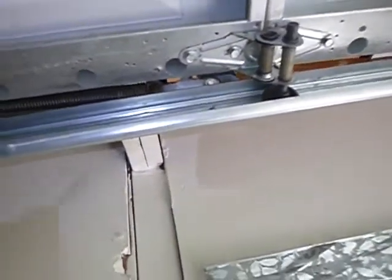Metal overhead door — no door opener. We're supposed to have spring tension notices right here. We have the child caution notice but it has manual locks. These springs are supposed to have a guide wire that goes inside them, so if the spring breaks, the guide wire would keep it in place and it wouldn't slap your face off or knock the windshield out of your car. When they go, they go with a lot of strength.